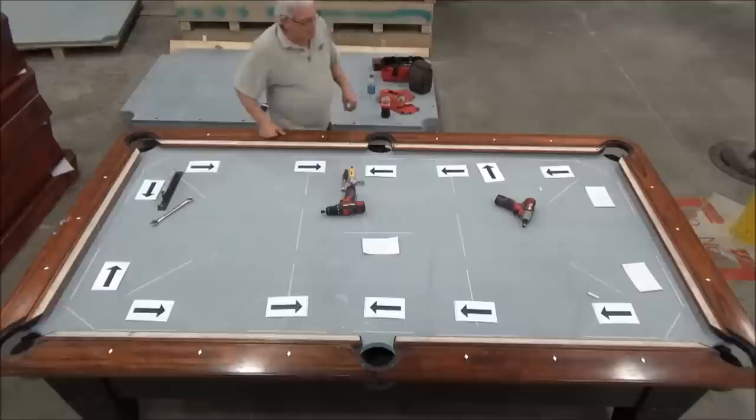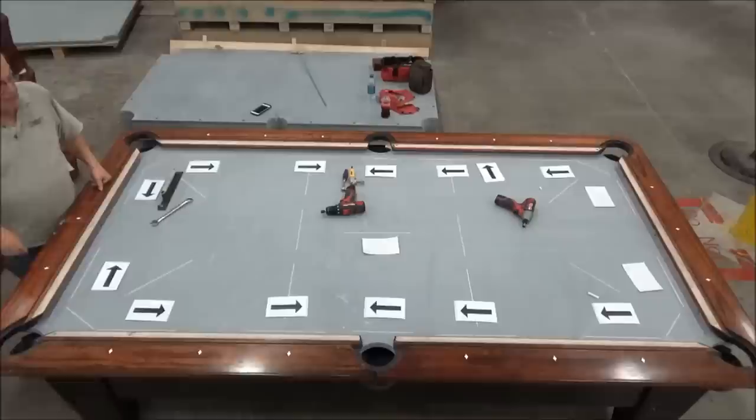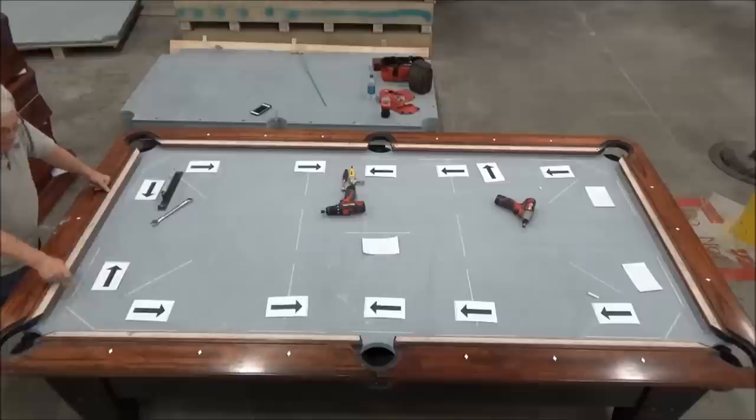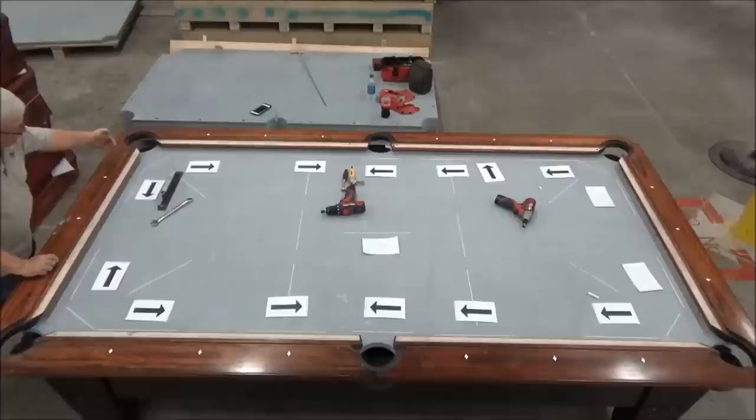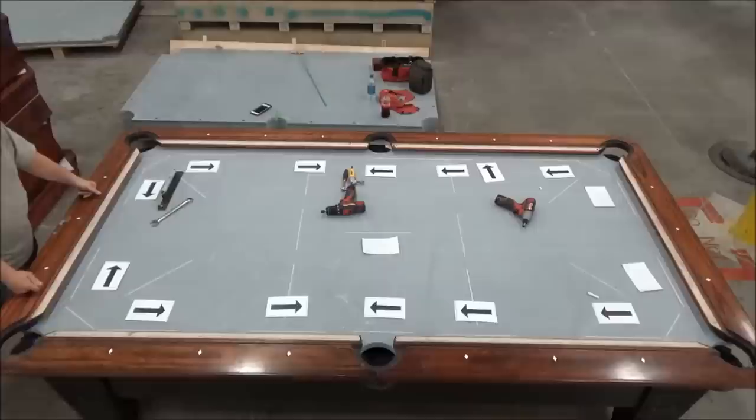And for the purposes of this video, I marked on the table places where I would typically make measurements to level a pool table. And the lines are roughly the length of the level, and they're the position where we would like to make the measurements, which these are all positioned, you know, in between wedges. That way, if it's low this way, if I raise this wedge, then it's going to raise this up. So if it's low like this and I raise this, then it makes this better. Because it's low this way, if I raise this, it makes both of them better. And that's what we're looking for in this table, or we're looking for adjacent low spots. You know, I refer to this personally as a low leveling system, because I'm looking for adjacent low spots and I'm using the wedges to elevate those up.